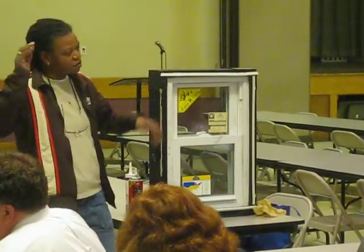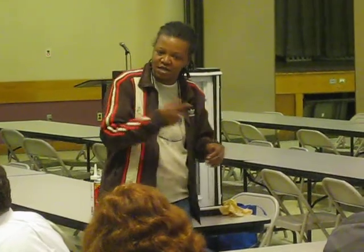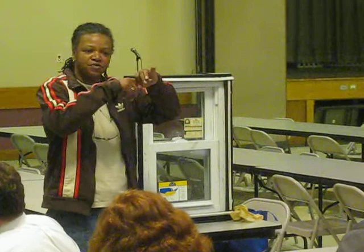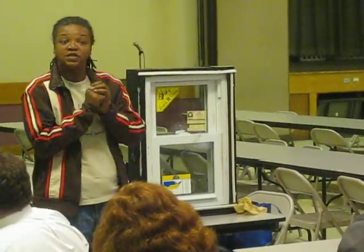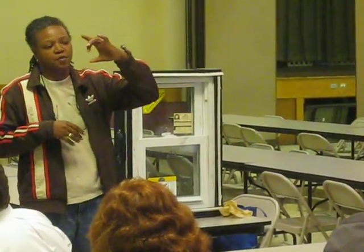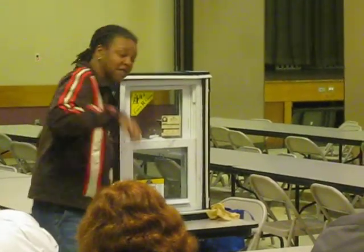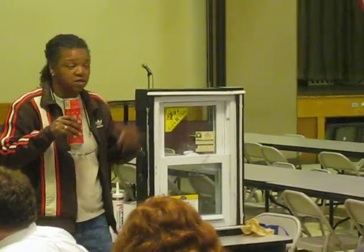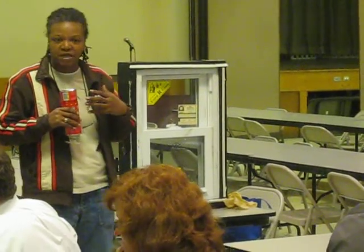The next thing in your basement — you've got your front wall, your back wall, and you've got your gas pipes, water pipes, and electrical wires coming in through the house. When they first drilled the hole and slid the pipes through, the mortar and cement was nice and tight. But over time, as things continue to shift, you end up with a void around the pipe. So clean around your pipes and wires, then take your foam and put it around the pipes — what we're trying to do is keep that cold air from getting in.